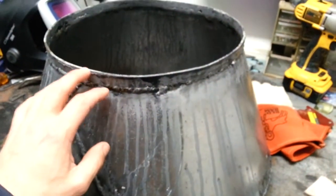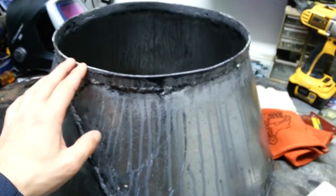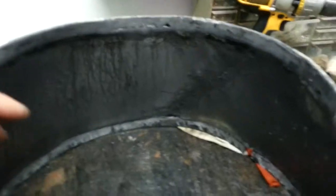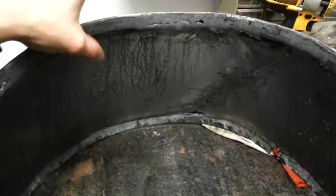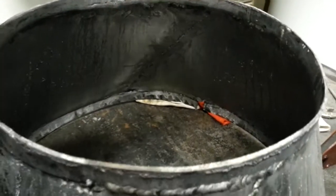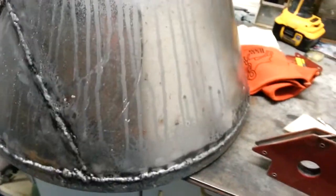Remember, this is only the form — the pour, the inner hearth piece. The inside has got to be clean, that's why I've been doing some grinding here. The inside is going to have to be flush to pour the cement. This will be the outer wall of the inner hearth, and then I'm going to have an insert that fits. Basically I'm going to weld a ring out here, then screw that down to a wooden plate, and then I'll be pouring the cement up here.